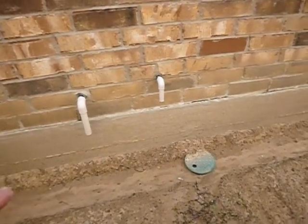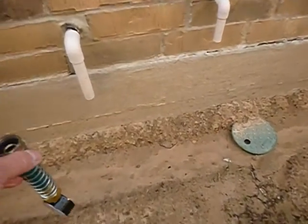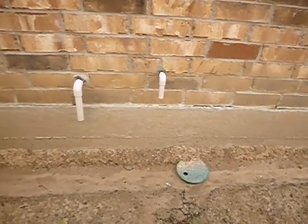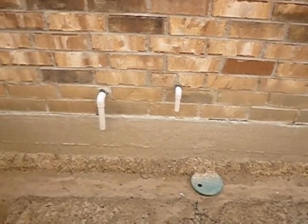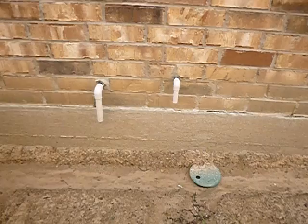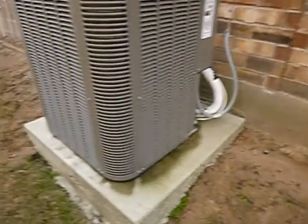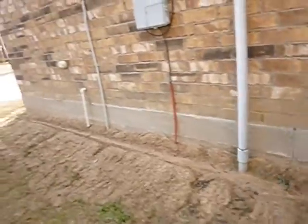They're not supposed to terminate higher from the ground than 6 inches and closer than 3, but that's not the problem here. They're too high. 200 degrees, 200 psi. It's like a steam engine. Your little dog's running through here. Just saying. Or a kid.